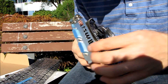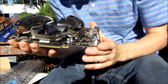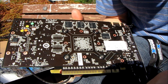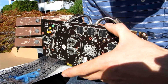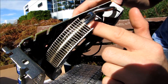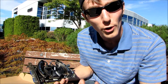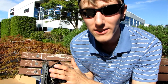MSI includes little covers on all the connectors, so I'm just removing those to show you the card in detail. I believe this card uses a reference PCB — you can see on the back there are blank spots where no RAM chips are installed. It looks like we have eight RAM chips for a total of one gig, and on the other side there are four more with two blank spots, so it could support up to 1.5 gigs of RAM. A GTS 450 with more RAM is possible in the future, though there's probably not much benefit on a mainstream card like this.